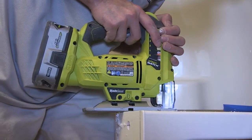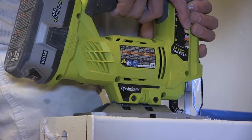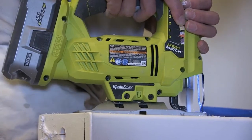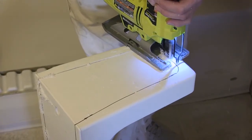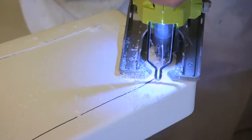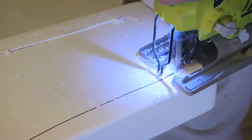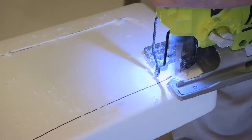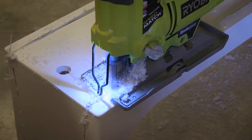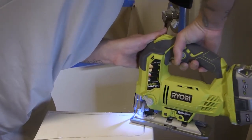The SureStep product is now ready to be cut. It is recommended that proper eye protection be worn while using the jigsaw. Place the product on protective material on your designated cutting area and cut the bottom of the product using the jigsaw. Make your cut directly on the center of the traced lines. Upon reaching the corners while cutting, tilt the jigsaw outward to prevent cutting past your lines on the vertical ends of the product. Remember to tilt your blade on each corner. On the ends, simply continue the cutting process with the jigsaw. When cutting around corners, swivel and continue cutting.